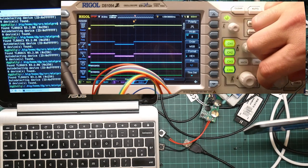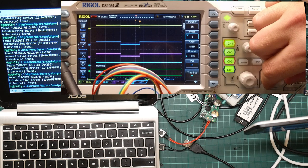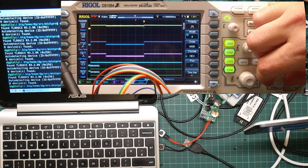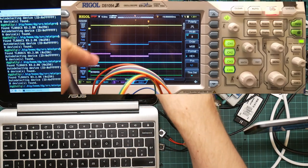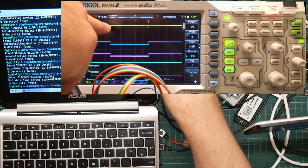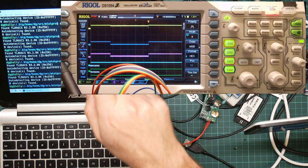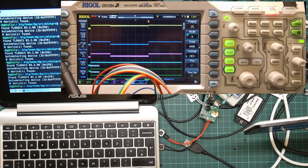Great, I can't reach the controls without either blocking something with an arm, either camera. Well, you can see chip select at the top, and that's looking very feeble. It's being lowered by the EEPROM programmer, but not very much. At the same time, the EEPROM programmer is lowering the clock and MISO. So I think I was right, and the EEPROM programmer is failing to assert chip select hard enough to make the chip wake up, because the microcontroller here has its finger on that particular control line.